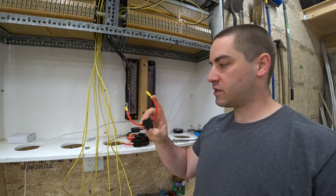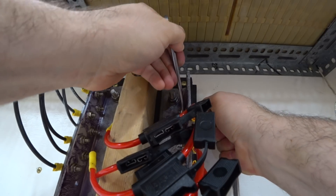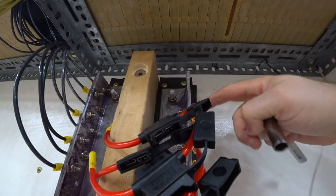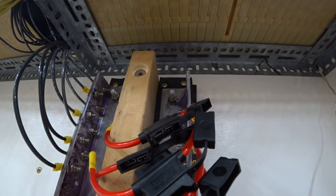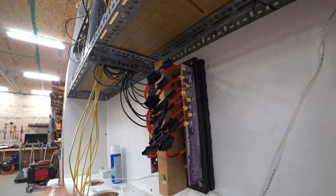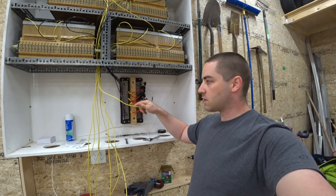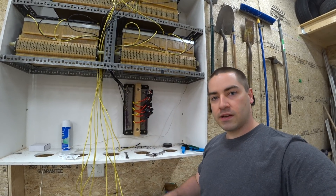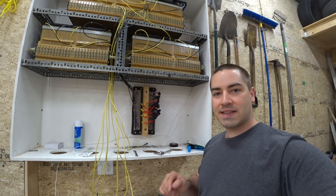I went ahead and put the splices and ring terminals on all eight of these fuse holders. With a through bolt, I can really sink this down, as opposed to if I had threaded the aluminum, where I would have had to be very careful. We have all the fuse holders in place and screwed on nice and tight. This is the shortest positive lead and I've got plenty of extra, so I'm going to measure it to the shortest length and cut every lead the same amount, so all leads are as short as possible but the exact same length.